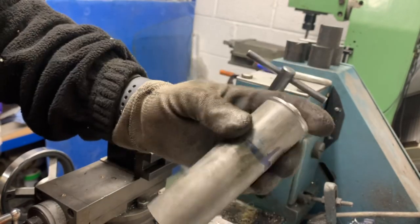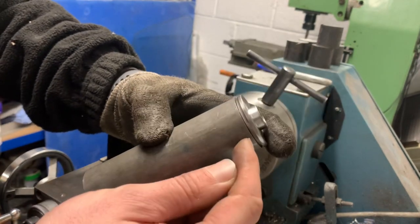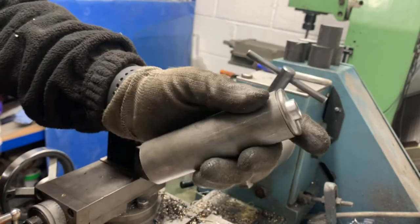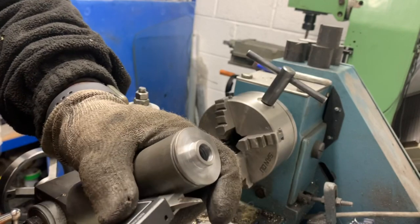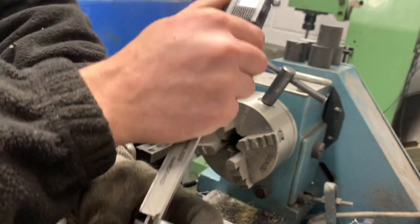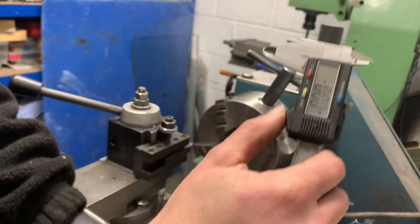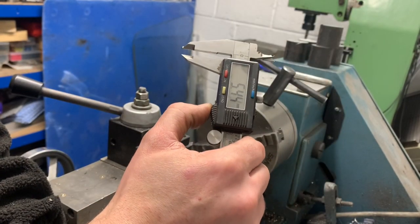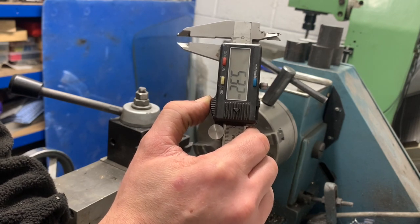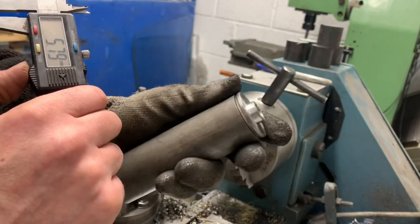Easy as pie, look. So even though it's a bit of machining, that'll get fully welded around there. That'll help just boost the shock off. It's about 5 mil, which is about what I did on this one. We want about 5 mil. We have 5.2, 5.4, I think I saw. 5.3. So, yeah. It looked like a guess, but I'm pretty good on the lathe.